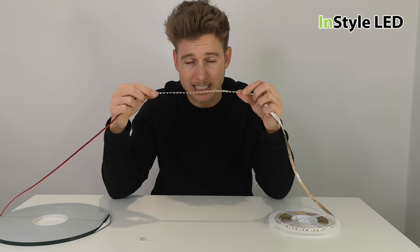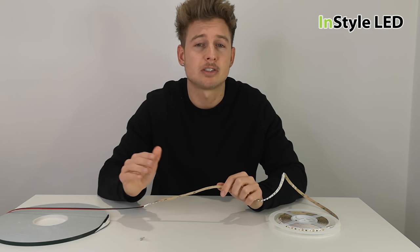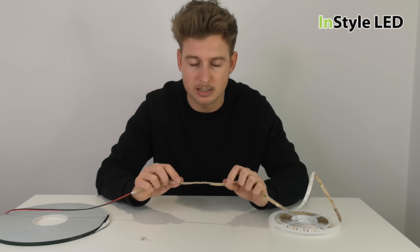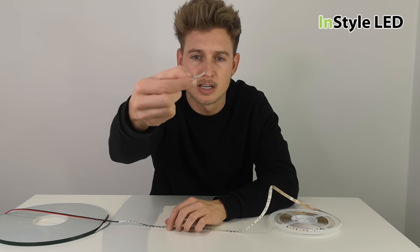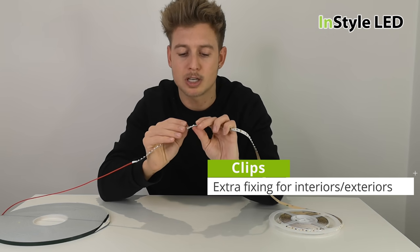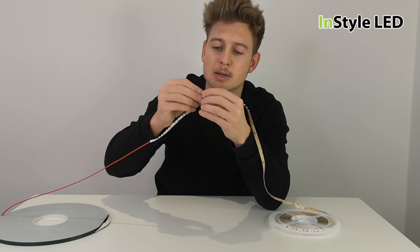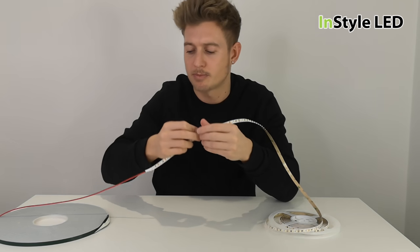So in this case, if the LED strip is being stuck underneath, or it's in an area like a bar or restaurant where it's underneath and can be touched, you should definitely be looking at other ways to keep the strip in place. Here we have fixing clips — these go over the LED strip. We have different types for the different tape widths: either 8, 10, or 12mm.